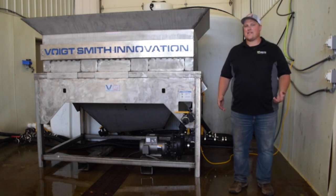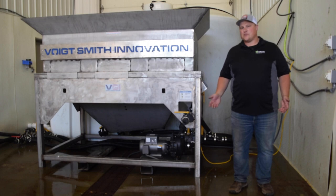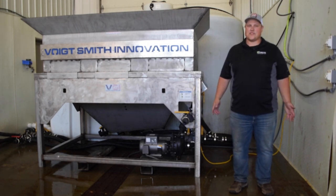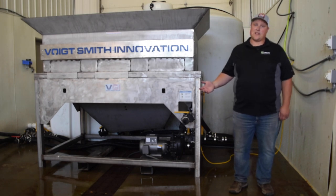We would always recommend that you mix your brine indoors. We get asked a lot about if people can make their brine outdoors. Maybe they don't have enough space inside. The answer is, could you make brine outside? Yes. However, you're going to lose a lot of efficiencies because you're going to always have to drain your system. You're going to have to flush your plumbing out to make sure things don't freeze up while it's sitting. So we have ours in a heated wash bay, like I mentioned.